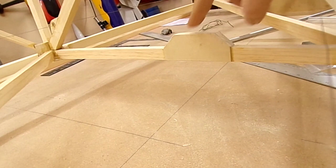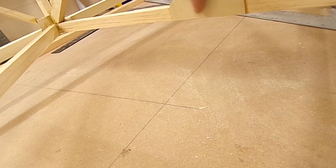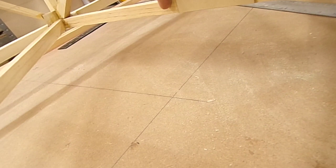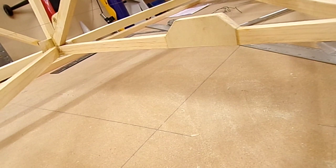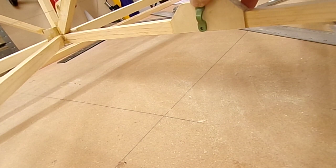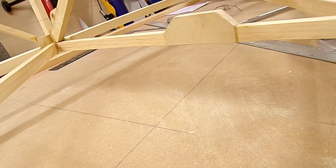I'll need to drill two mounting holes in the front and I'm looking at doing three mounting holes at the rear for the screws. Here's a bit I've added to this cross member for my trim system — mounted on here will be the pulley setup to go towards the front end. This will be stiffened up a little more by ply sections coming off the cross member onto the lower stringers to help triangulate things. I've got this little bracket section that will be drilled to accept that, and there will be a couple of pulleys on there, but I'll go into more detail on the trim system once it's completed.